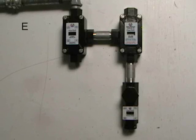and the extension module, also known as the XMO, which is typically used when the detector is installed in locations that are inaccessible for viewing or to make it easier to perform calibration, such as above drop ceilings or if they are mounted down into pits. These modules can be mounted up to 400 feet between each other and the detector head.